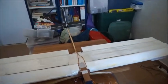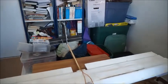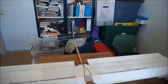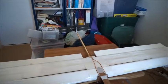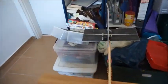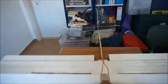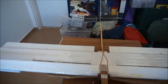Something I didn't show last time was these full-span ailerons. They really have a strong effect on the roll. And this tail has quite a lot of deflection compared to some more conventional stuff — though for 3D airplanes, that's not a whole lot of deflection. I suspect the lack of effectiveness of the rudder will be greatly improved when I replace this wooden, floppy control — which torsions and flops around on all axes — with a carbon fiber tube.